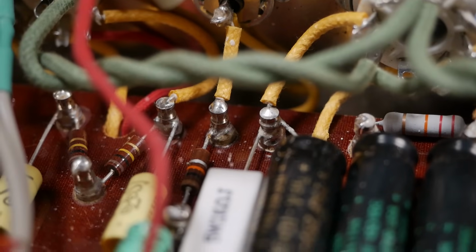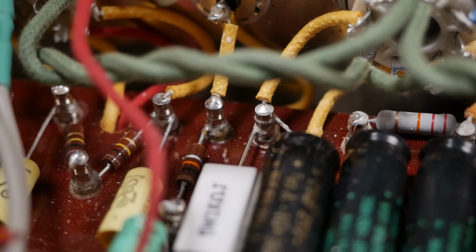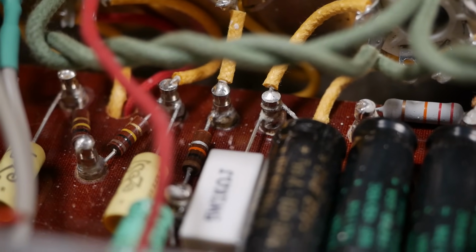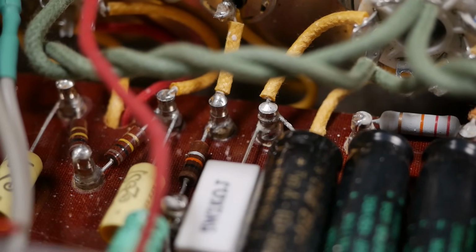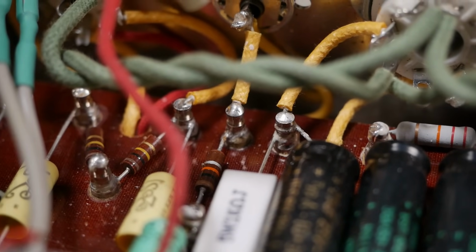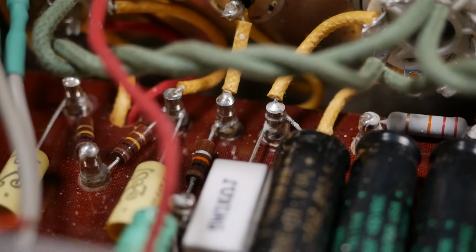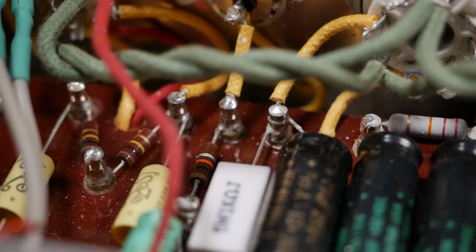When you do it like this, the part you don't generally need to remove, the wire, is easy to remove, and the components are an absolute dog to remove because they're wrapped around the turrets and down underneath everything else. So yeah, with turret construction I do it the other way around. I put the wire around the turret and the component through the top, because to me the component is the thing that needs to be serviced. If your wiring needs replacement and servicing, then you've probably done something wrong in the first place.